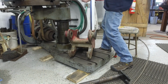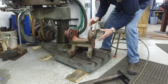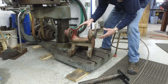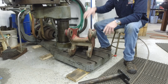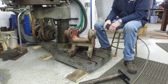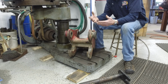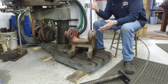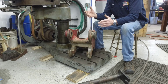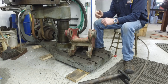Okay, let me go over the plan of setting the bar up. Now we need to make this simple and easy and self-aligning to the bore of the individual item, because I'm not going to clamp this down to the base and then have a bar that's dialed into the spindle of the drill press. The beauty of being able to do this is it gives you line bores in relationship to the bore location of the part, and just have the drill press do the drive of rotating your spindle and controlling the feed of your spindle, or the travel in either direction of your spindle.